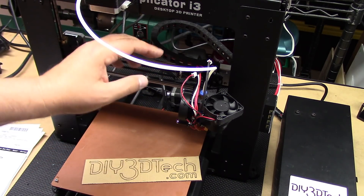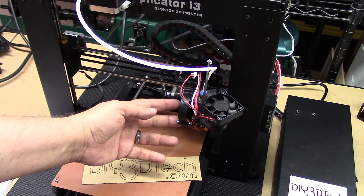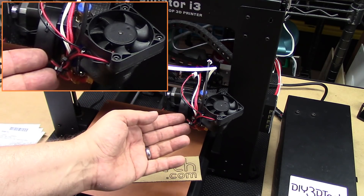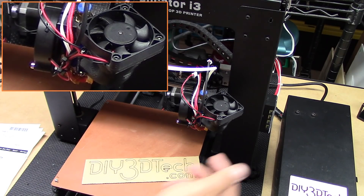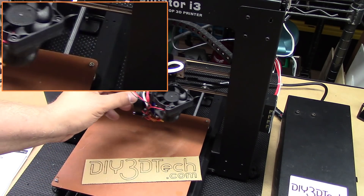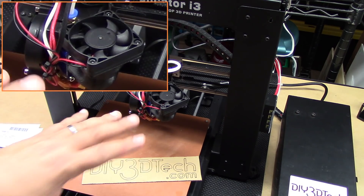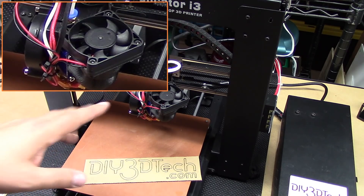Okay, welcome back. We've got it assembled — you can see how it all goes together. Because I've installed a radial fan over here, the other mount would hit it when it came out — that piece wouldn't clear it. I also had to put all the wires out the front to clear the radial fan, so I can't have it stick straight out. This was a really good option because it allows me to turn it sideways at basically a 45-degree angle, and it clears the frame of the Wanhao. I've basically doubled my airflow over the cold end.